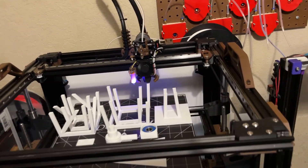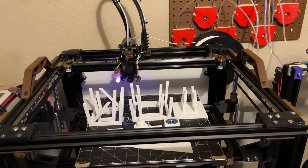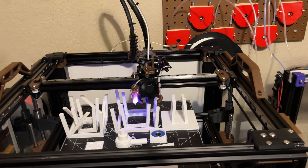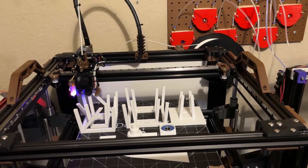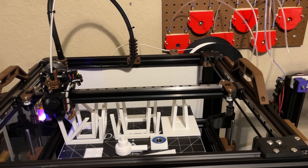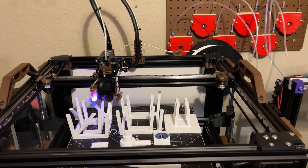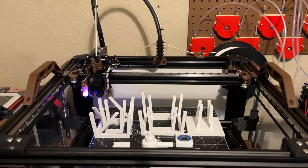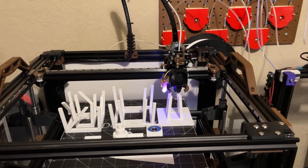As far as speed, this thing is really fast — I can see why everybody was pushing me to build this. This is the first printer where after tuning and running input shaper, I got results recommending MZV, one of the lighter algorithms. On my X it recommended 17K acceleration, and on my Y it was recommending 15K acceleration right off the bat. That is very impressive.